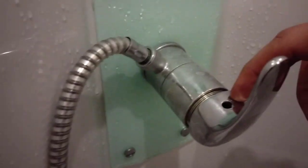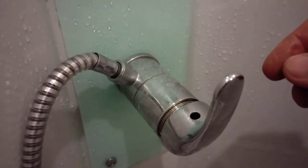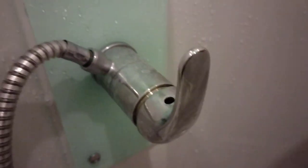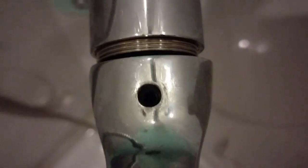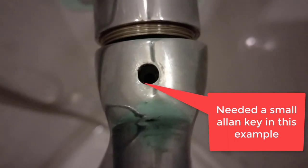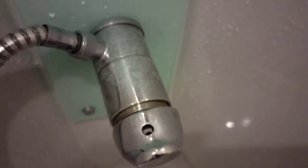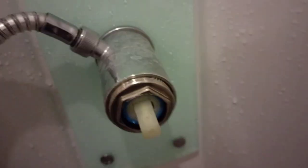The first thing — there's a little cover on the top here which we need to remove, which I've already done. I just used a little screwdriver to remove that cover. So that's what the cover looks like, and once we've done that there's a grub screw in the top. You need to get a torch, find the right allen key size, and undo that grub screw. You can just about see it there, and then this will come off just like that.